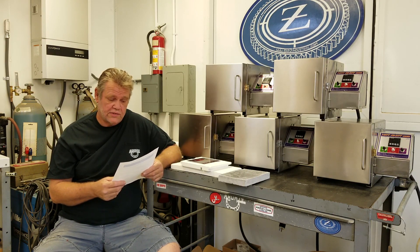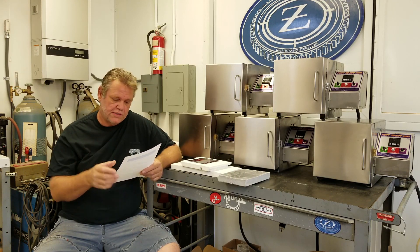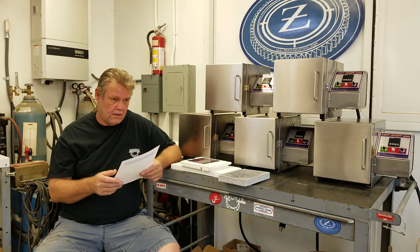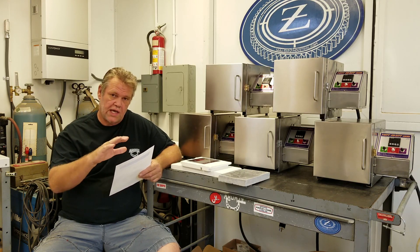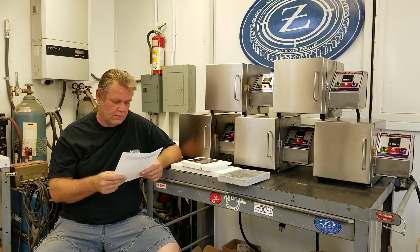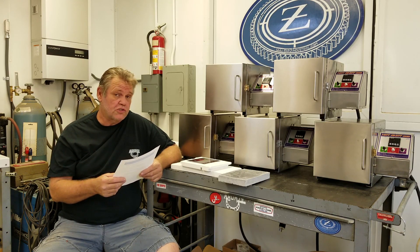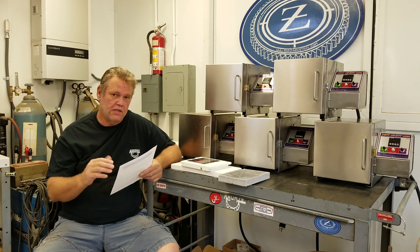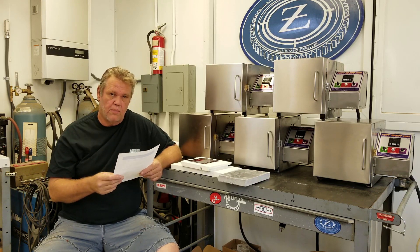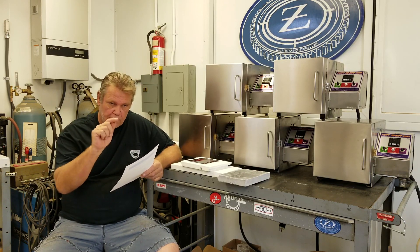It's got a heat sink on the SSR and it's forced air cooled, with a 120 millimeter cooling fan with auto cool down feature. It has thermal protection in the panel cover — a push-to-reset type breaker covering just the element — and overload protection for the controls inside the cabinet using a small glass fuse. It also has a heat enable switch so you can quickly kill the element, open the door, get parts in and out, and go back to heating without pushing buttons on the controller.